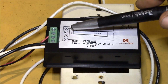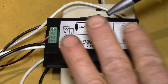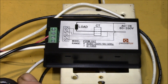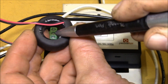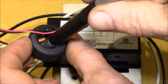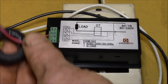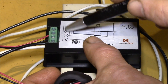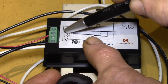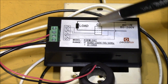The way you need to look at this diagram is to realize that all the wires are coming out of this side, so you almost have to flip the diagram over. There are two basic connections: here's your current transformer, or CT as shown in the diagram, and you run one of the load conductors through it to measure the current. I recommend hooking this up first — you want to make sure these two small wires go to the two top terminals. If you accidentally hook the voltage up to those terminals, you'll blow up the meter.